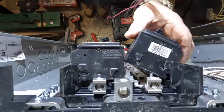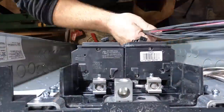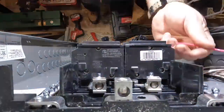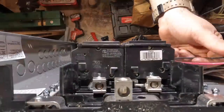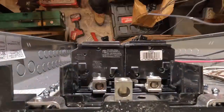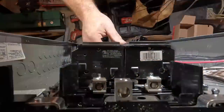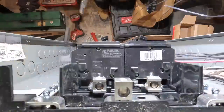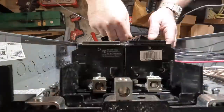Here's an interesting camera angle — I have a magnetic mount for the GoPro and I put it on the top. Unfortunately, the mistake I made was putting the circuit breakers in at the top first, so you can't see me lining them up. If I do this again, I would put the breakers in at the bottom and work my way up for a better camera view. I believe I had about 20 circuits — one double-pole 40 amp which feeds out to another sub panel off camera. There are a lot of 12-wire circuits in that panel, and everything else is single pole.